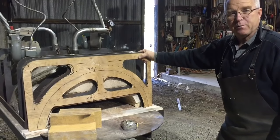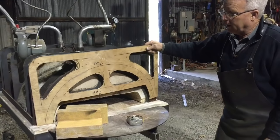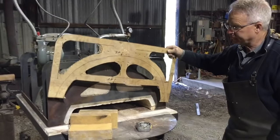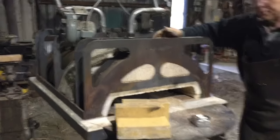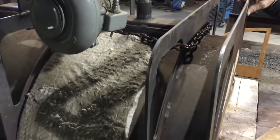The design I came up with had to be an appropriate blend of form and function. I ended up coming to rest with this shape for the trusses that provide the stiffness in the barrel. The trusses were CNC plasma cut out of quarter inch plate. The barrel itself is 3/16ths plate, was rolled into a half-round configuration.